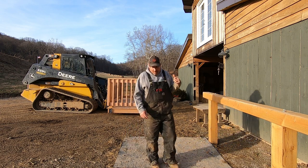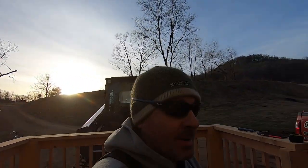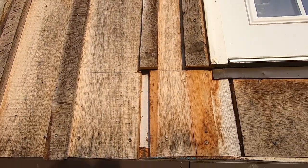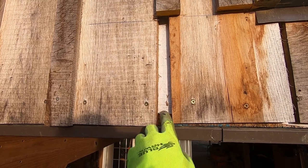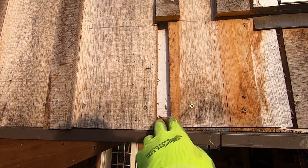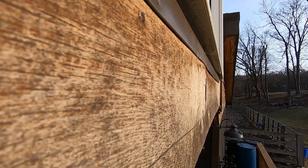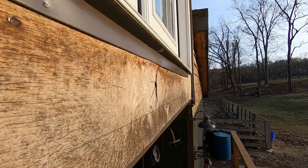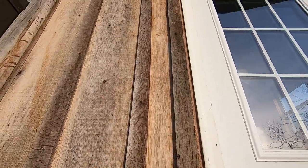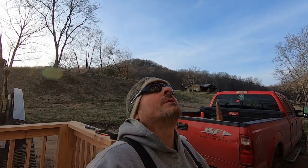This thing will be ready for probably a coat of Thompson's Water Seal this spring. I'm getting these bats cut off this board — it's white oak — and I wanted to show you something. I put this up green, put it up tight. Look at that: almost a two-finger gap on white oak. And now looking down the middle of this, the knot has spalled out, so I've got to take the planer and try to get that flush. White oak is a cool wood, but man, it does some crazy stuff when it wants to dry.